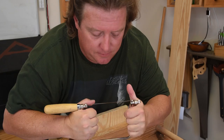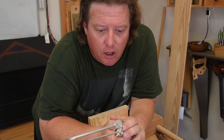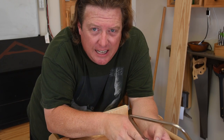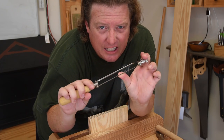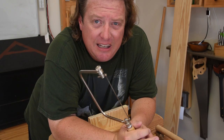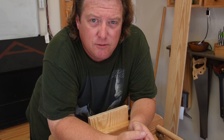They flex. They move so that you can't really hold the blade in tension. Now this is set up traditionally in a push configuration, and you could just flip the blade around and get it in the pull configuration so it would maintain strength and a straight line, but you will still flex it. I mean, this thing is really flexible. To me, this is just a rough cutting tool. I know some people will actually cut inlays and stuff with that one, but for me, it's just rough cutting, and its only main purpose for me is cutting out the waste of joints like this right here.